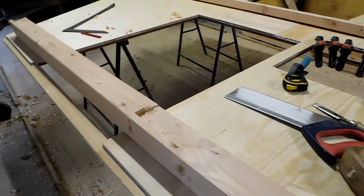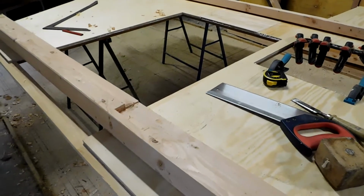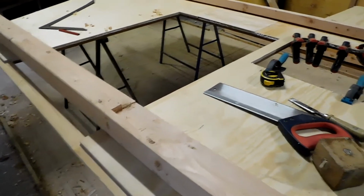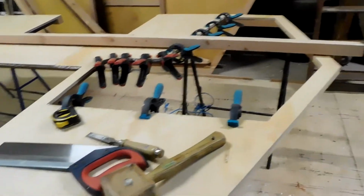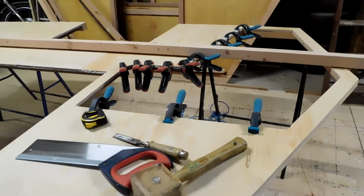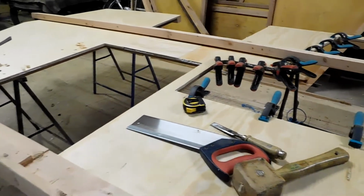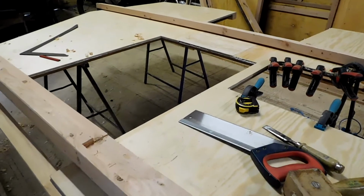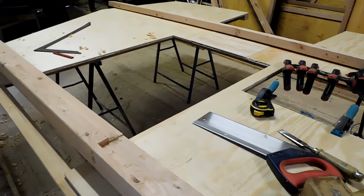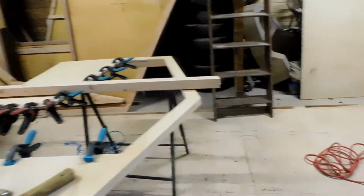This is the aft side, as I said. The forward side is complete, just needs sanding up. Glass and epoxy on the ply, but the trim all needs sanding up. This side I'm about to start fitting. I said that floor beam, the battens around that deck beam, and the pieces that the engine room hatch shuts against. So that's where we are. All looking quite good. I'll just scan over here a bit.